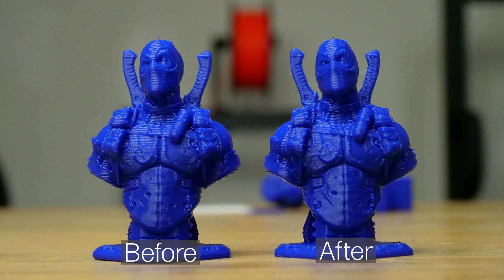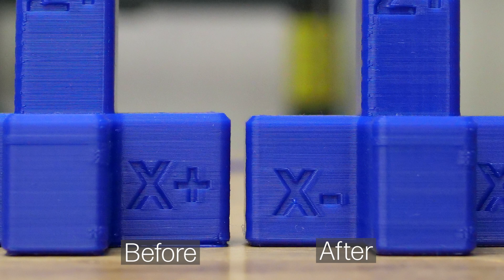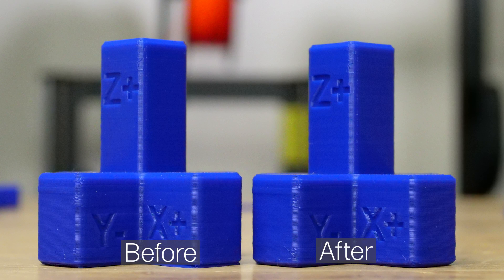For printing there's very little to report. Noise levels are greatly reduced, which is a major bonus — typically achieved by any 32-bit control board or one using TMC 2000-series drivers. Print quality doesn't appear to be meaningfully affected. There is also the Robin E3D variant — which has nothing to do with E3D Online the nozzle company — it simply comes with swappable drivers, hence the D. If you already have good drivers, that could be a good alternative.